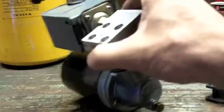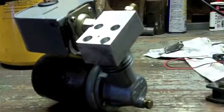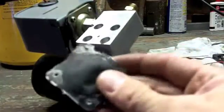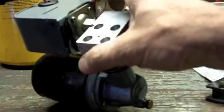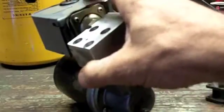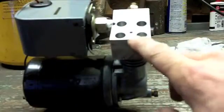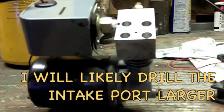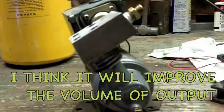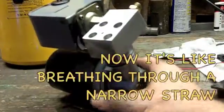There's no more silicone here. I want this to be a long-term compressor I don't ever have to think about again. So I took out the burned diaphragm — the one I TIG welded and messed up — and tried a bicycle inner tube I had laying around with a big tear in it, and the rubber seems to be holding really well. I made a new diaphragm out of that. Silicone is gone. I'm going to leave this block machined as it sits. I thought about cutting cooling fins into the top, but it's not feasible without a mill.